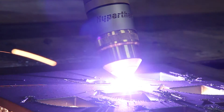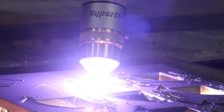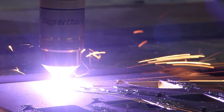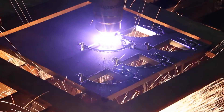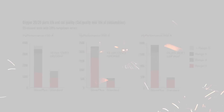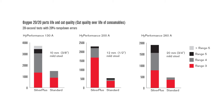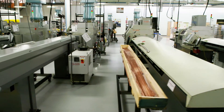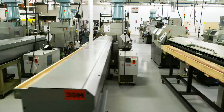So what does all this mean for your operation? Typically, companies that use Silver Plus electrodes experience double the life of electrodes and nozzles, which reduces the cost of their cutting operation. The graphs pictured here show the improved life of Silver Plus electrodes over standard Hypertherm copper electrodes. Please contact your authorized Hypertherm dealer to arrange to receive a sample of Silver Plus electrodes. Please also see our video on the different silver copper electrode technologies and why Hypertherm's is the best.